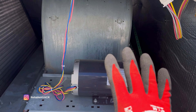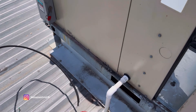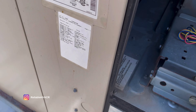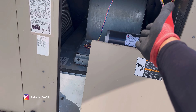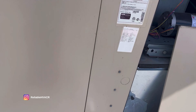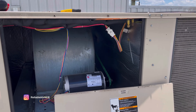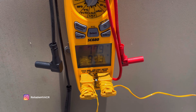I use those temporarily - I think you can leave them in but I wouldn't recommend it, it's more like a tool and it's way more expensive. So it's a Sunday, we'll get them by for the day and they'll have cooling until I can get to the supply house Monday morning. We'll pick that up, come back, remove that one and put the proper belt in. Very easy - all I need is a needle nose to fish out the little clips. I do have a video where I go more in depth on it. Let's turn this back on and see if the blower comes on first.